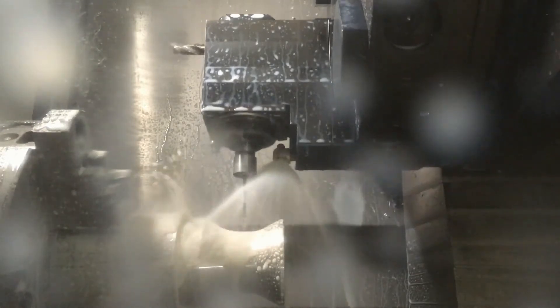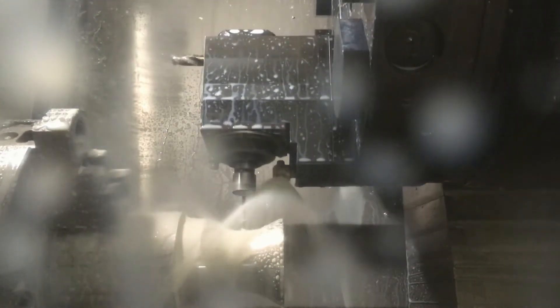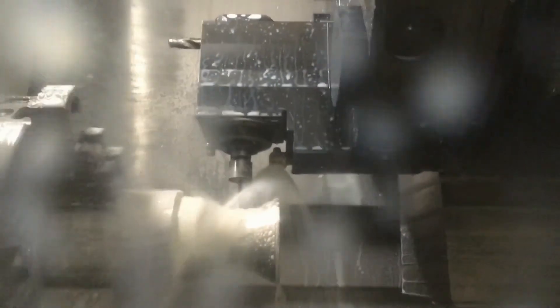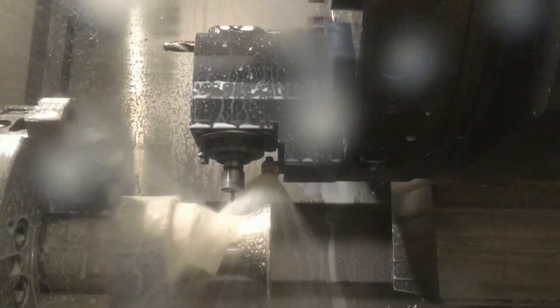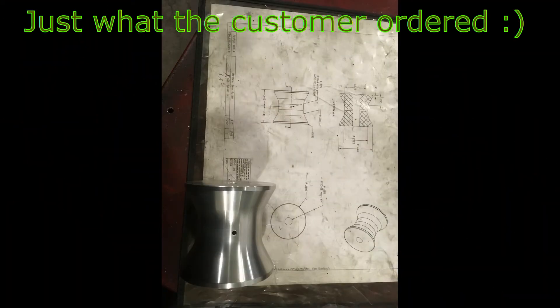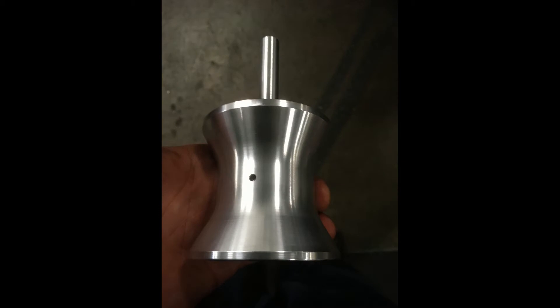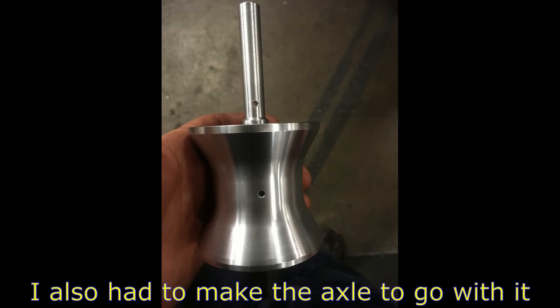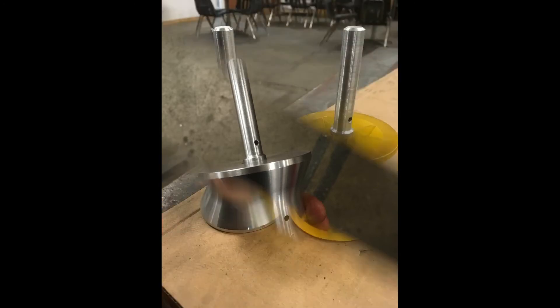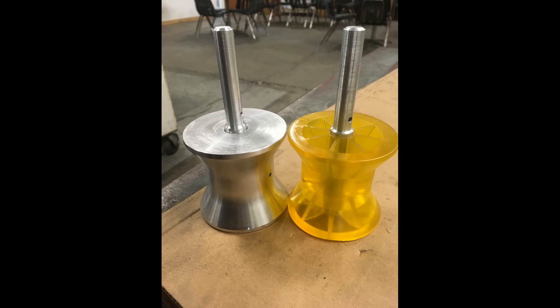This is pretty cool — it's an eighth-inch drill bit and we're drilling in through the side of the part down into the center bore so we can fit an axle drive shaft in it later to allow it to couple to the electric motor. There's the print and the final part before the axle shaft, there's the axle shaft installed in it and the roll pin driven through. It turned out really nice — the customer was more than pleased with it, and I'm hoping it's serving him well for pulling crab pots.